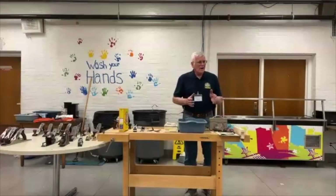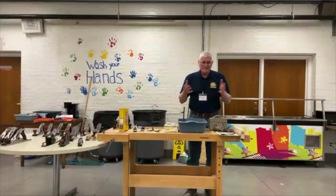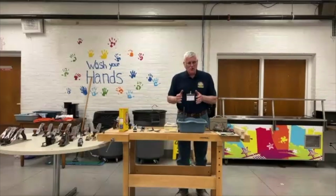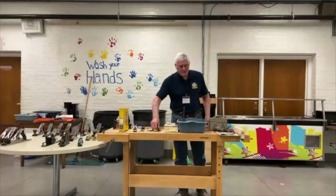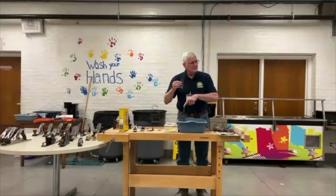And it takes a while. You won't see anything in the beginning. I usually let this stuff, I call it cooking. And that's because I've seen that on the internet, and that's what the other guys called it. So I let mine cook. The first time I did it, I cooked it for about 4 hours. And it took a little bit of rust off, but that's not long enough. Over time, I found that 2 full days worked perfectly. After 2 full days, all the rust that's on here will be gone, and it'll be on here. It'll be attracted to the rebar.